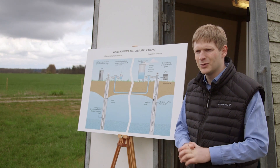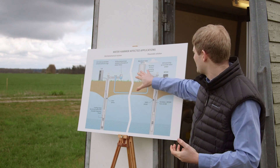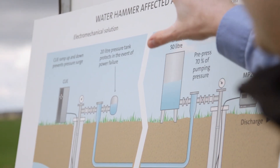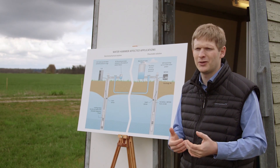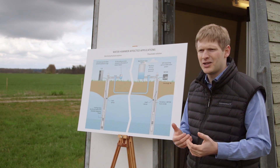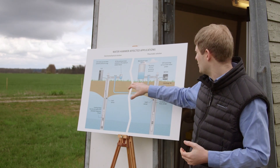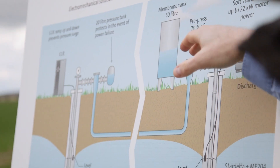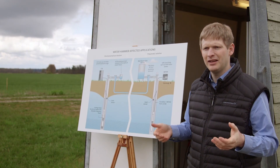This shows how it is usually done: you take a tank with a pre-stress of the air at about seventy percent of the pumping pressure and place it after the pump wellhead. This gives the most effective dampening in order to mitigate water hammer issues.